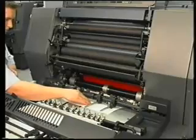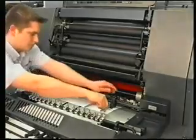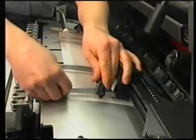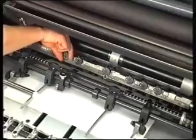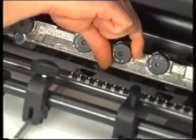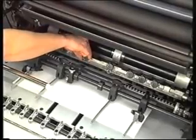The sheet smoothers with steadier brushes are secured to the crossbar by means of the thumb screw so that the guards are located approximately 1 millimeter or 0.04 inches above the sheet. The two outer smoothers should be positioned over the paper about 1 centimeter or 0.39 inches from the edge. The front lays relative to the sheet format are set to a middle position. The front lays that are not needed are disengaged by turning them in plus direction.